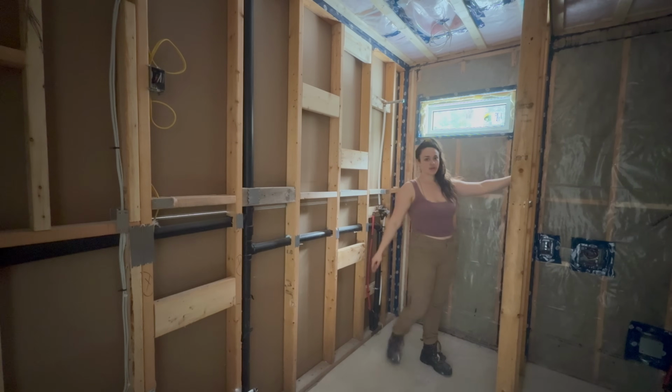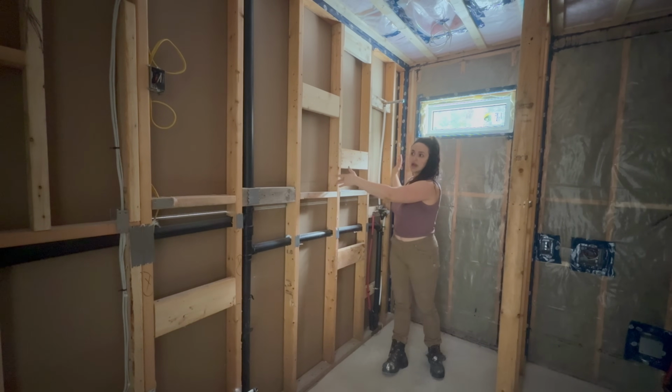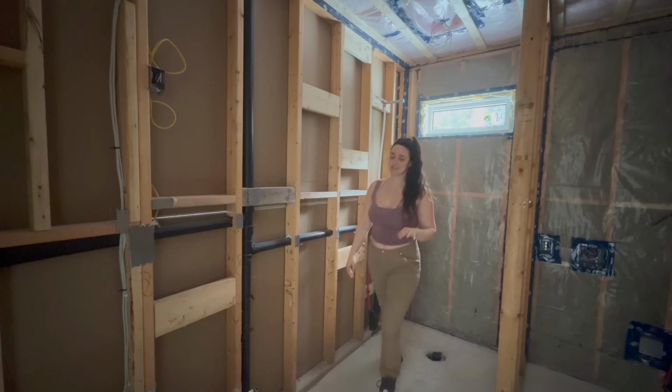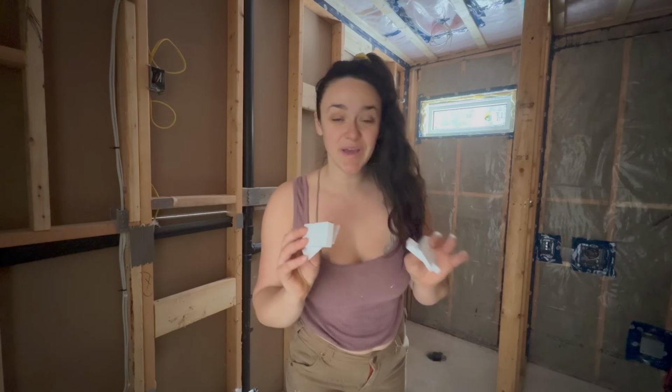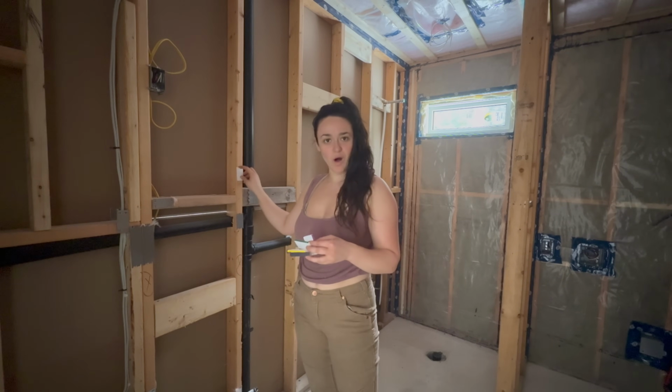And so this wall needs to be shimmed, this wall, and because we need to do this section of the shower, this whole wall needs to be done. This is the easier of the two rooms. And these are the foam shims going all the way up to a half inch. They're color coded and you just PL them to the wall where you need them.